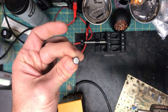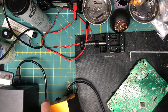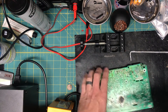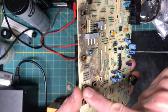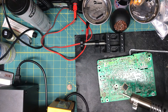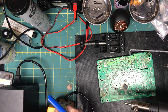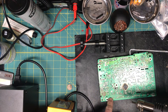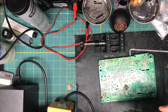That shrunk onto what's almost like 12 gauge wire. Now let me crank it up to 500 degrees to do some desoldering. I'm going to desolder some rusty buttons I've got marked here. I'll use a solder sucker — heat up the joint and then pop the solder off. The circuit board might crackle but I don't really care about the board, just the part. It's already up to 500.